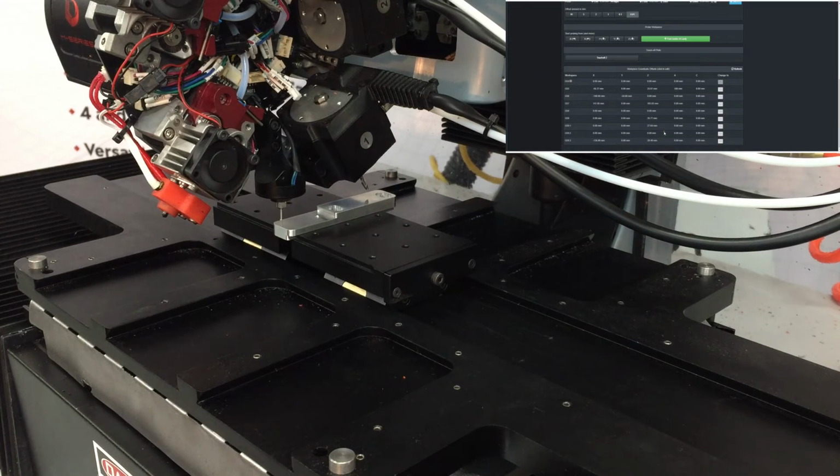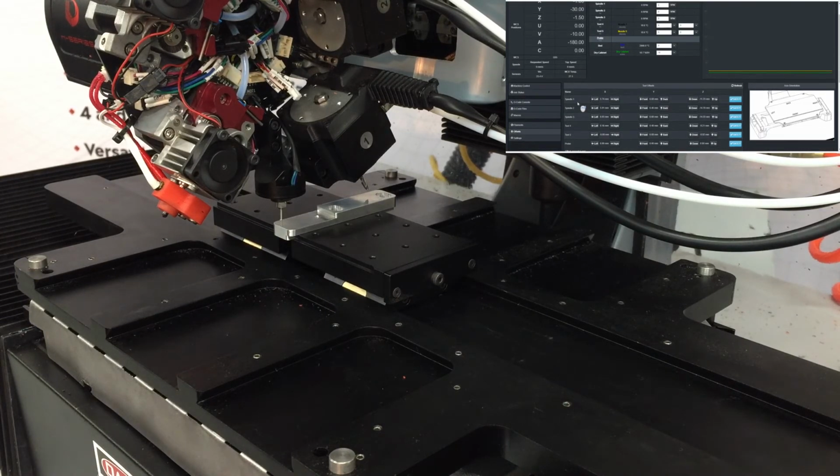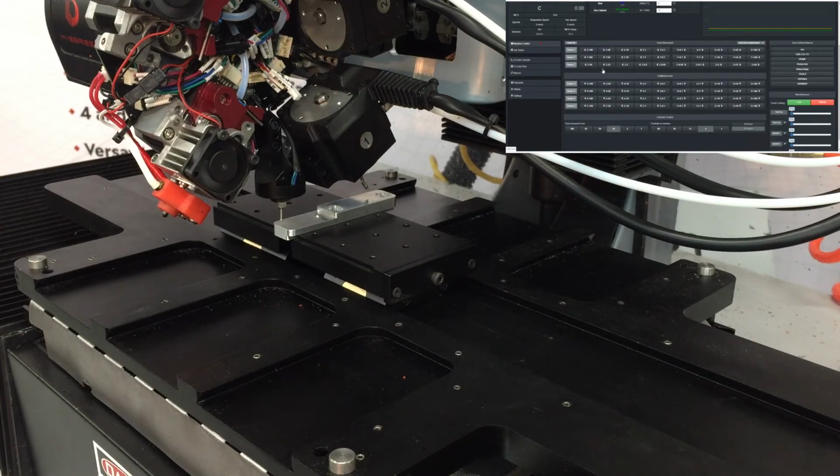So, and again, just to double check, let me go into G55 mode, and I'm at X of negative 1. I can stay in this mode while I'm doing this probing. There's no reason really to be switching back and forth. Sometimes you'll want to know what your coordinate values are in reference, but for now, I'll just stay in G55 mode, go back to my machine control, come off of my part.